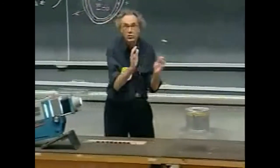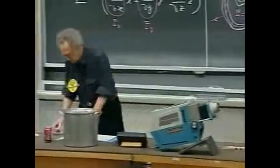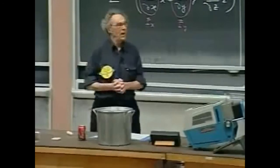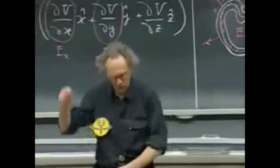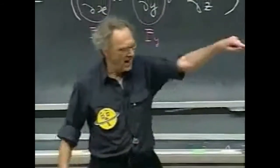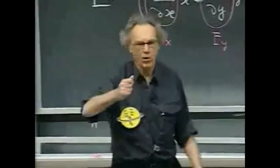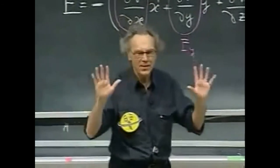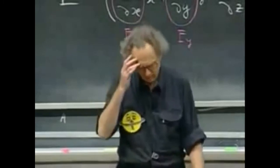You see it in front of your own eyes — all the charge goes to the outside. Not so intuitive, but an immediate consequence of the fact that it's a conductor: the electrons move freely so that the electric field in the conductor itself is zero. We have argued that no charge can ever go on the inside of the surface — it all stays on the outside. So if you are inside that conductor, if your house is a conducting house, and someone in the outside world charges your house up, when you're inside, you have no knowledge of that. You are electrically shielded from the outside world.